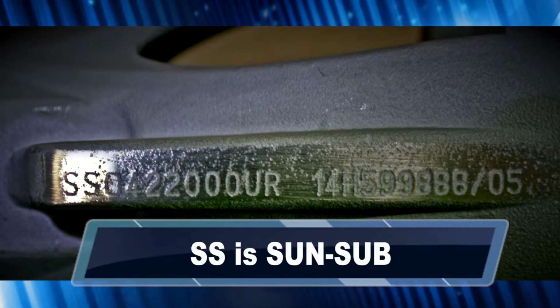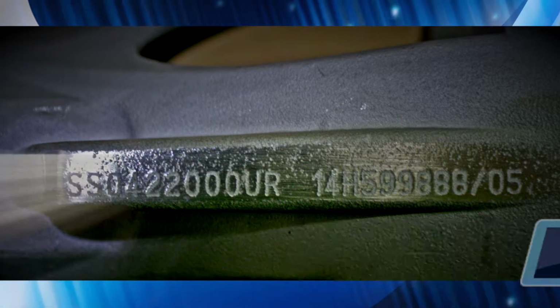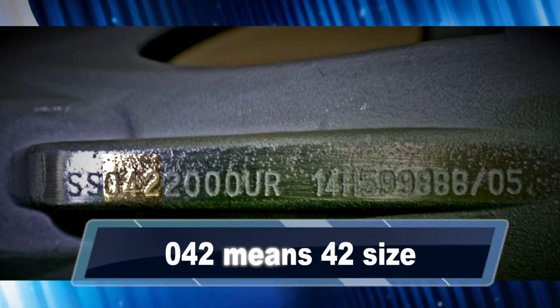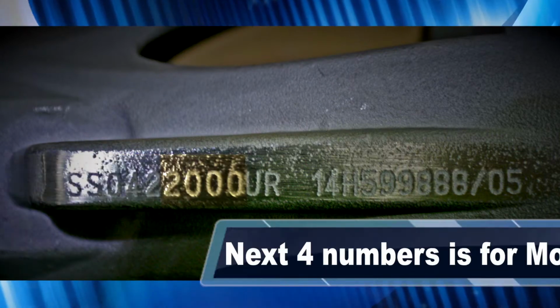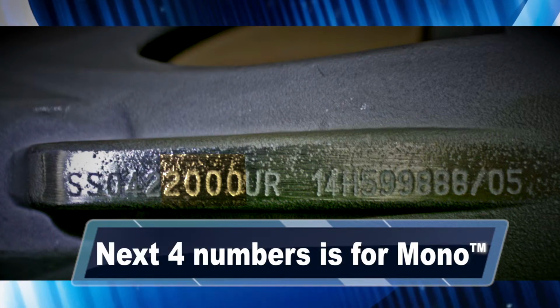The first 2 characters, SS, identify the unit as a Sun Sub. The next 3 numbers are the pump size. Seen here, the 042 is a 42 size. The following 4 numerics are an internal Mono sequence number.